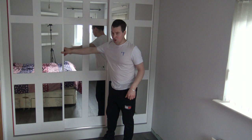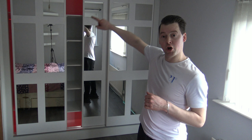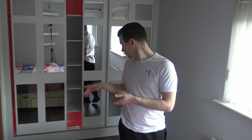So we have three doors, right? Let me go into detail first. The wardrobe has what they call a full surround around the outside. Sliding wardrobes usually go from the roof to the ground. This wardrobe has a step of about, I think it's 170mm or something at the bottom and the top. The reason it's like that is that I haven't used MDF doors or chipboard doors. These doors are solid pine doors. You will see in the images at the end of the video the preparation that went into them. I have routered the doors. I removed 60mm off them first by cutting them, then routered them to leave them dead straight. On these edges, before I put the nice radius curve on them, I cleaned them with the router. On the two sides of each door, the doors are still approximately 2 meters tall.